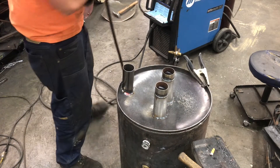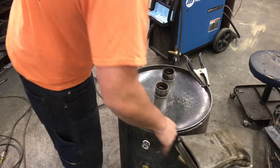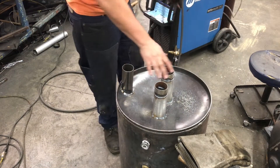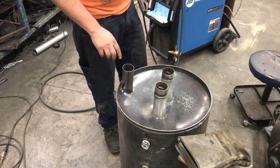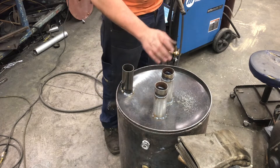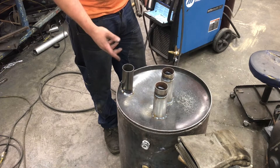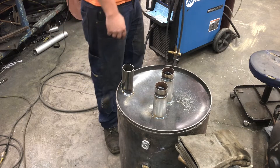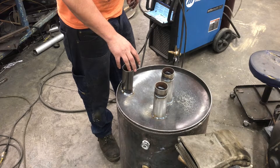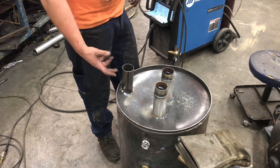I don't have a fill lid for this yet, so it's going to be a little bit difficult to water test it right now, but I'm not too worried about that. I've already got some holes cut in the bed where these two will slide down through it and this one will as well. These two hang about an inch and a half below the bottom of the bed boards — just enough room to slide onto a 90-degree PVC fitting. This pipe is two-and-a-quarter exhaust because that's all I have; I'm working with the last little bits of material. A two-inch Fernco cap will slide onto this just fine, and this is also going to be completely hidden behind the bed rail frame but still easily accessible for draining.